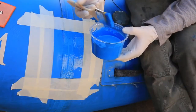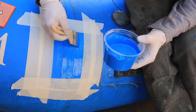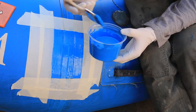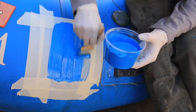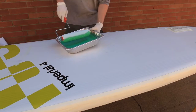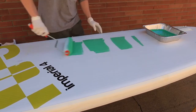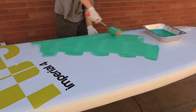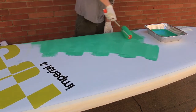Step 4: Do not coat in direct sunlight. Make sure there is plenty of ventilation, that you are wearing the correct respirator, rubber gloves, and protective clothing. Step 5: Do not breathe fumes or get the urethane on your skin. Begin coating the area where you want the thickest layer first. Wait 15 to 20 minutes between coats. If sagging occurs, give more time between coats. Do not allow the urethane to touch the masking until the final coat — moving from the center of the area to the outside will allow for optimal build and symmetry. Remove the masking after the final coat has started to cure, about 30 minutes. Recommended thickness for the bottom chafer is about 30 to 40 mils, about the thickness of a credit card. Other areas should be about 10 to 20 mils. Each rolled coat should add 4 to 6 mils, so the bottom chafer should be 7 coats at the thickest point.